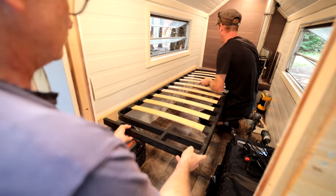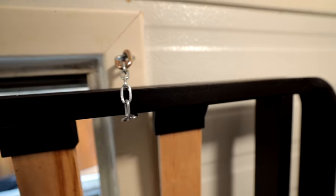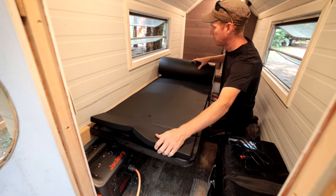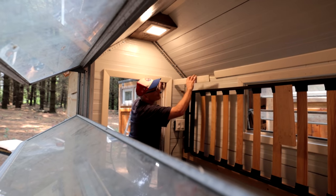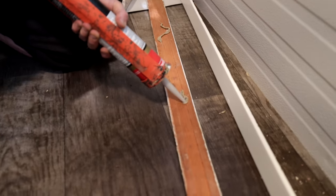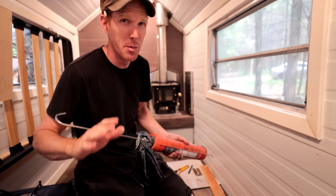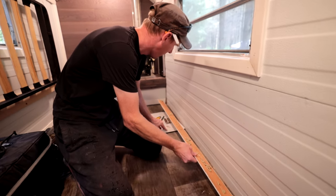How's that for a fold-away bed? Everything folds like a murphy bed. We got a couple more pieces of trim to put on and then more features to install, because this thing's getting glamorous real fast. We're going to install some baseboard, and because it's rattling around a lot we're actually gluing everything. If you're going to do this in your house, just don't glue it, because taking glued baseboard off is not fun — it's kind of a permanent thing. We're using PL Premium, gluing it on, and the nails are holding it temporarily until the glue sets up.